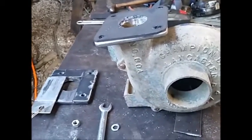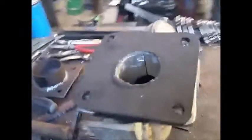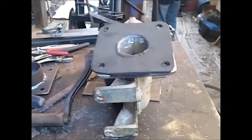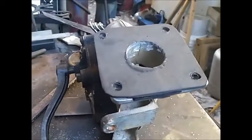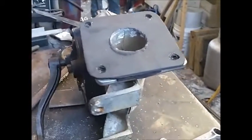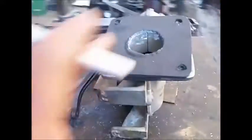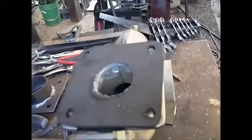All right, how to make a gate for your blower — a hand crank blower. Why in the world would anybody want to put a gate on a hand crank blower? I know what you're thinking: if you don't want air coming out of it just don't crank the thing. Well, that's not the point. We're trying to keep air from going back to it, because as you can see the light through there — if air goes back to this it's coming straight out of there, and that's what's happening on our forge because we have an electric fan and a hand crank fan.